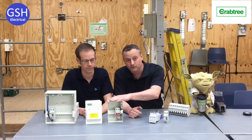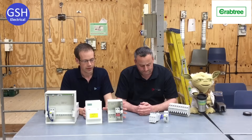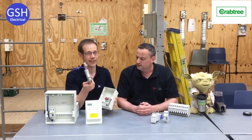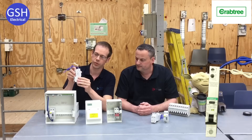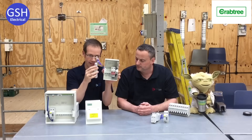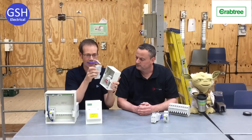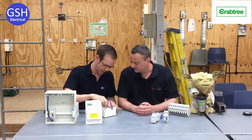We'd like to move across to a standard double-pole or linked main switch within the Consumer Units, but we're going to have some issues. What are those issues Joe? The main issue is that when you look at the size of a traditional RCBO, they've got these big blocks on the top that house a lot of the electronics that handle the RCD protection side of things. Comparing this to our standard box, you can see it takes up an awful lot of room — if I just pop this in, you can see how much room it does take up inside there.